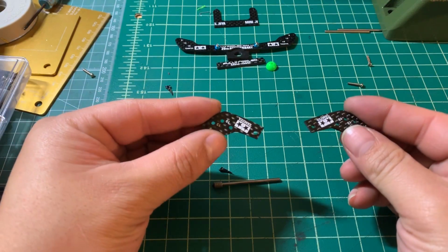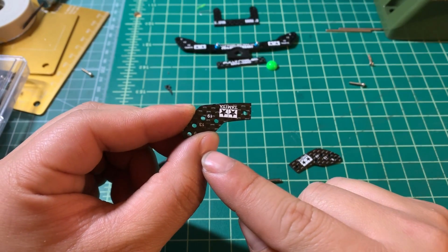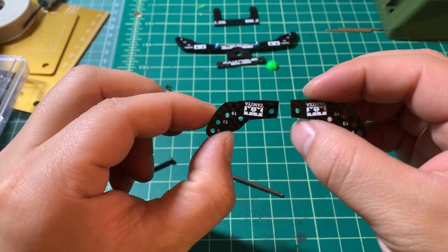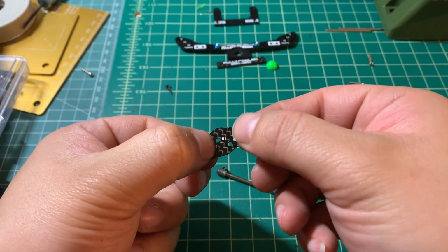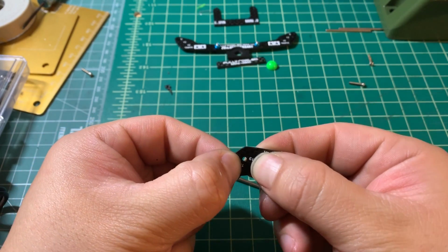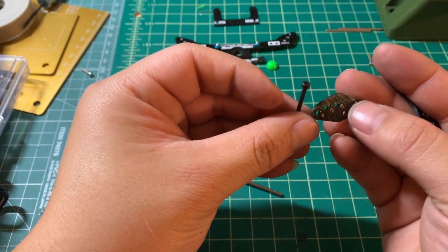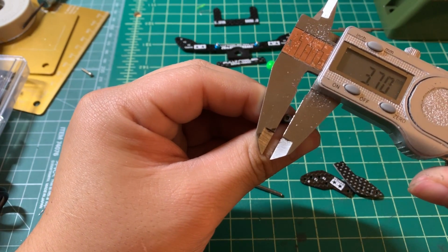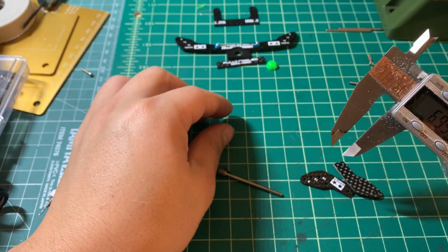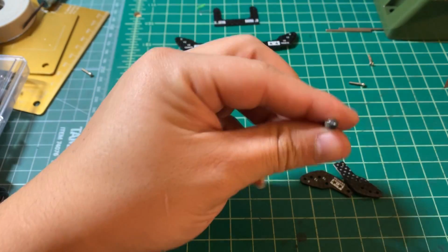Next, our final modification, the underguard. Depending on what size of roller you are going to use. In today's setting, I'm going to use 19mm rollers. On these two underplay pieces, I'm going to expand the hole for the 19mm roller a little bit bigger, in order to fit the head of the 2mm cap screw. The head of the 2mm cap screw is about 3.7mm in diameter, so I'm going to expand it to around 4.2 to 4.5 millimeters.